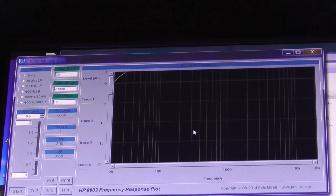Now, ideally, if I can, I want to be able to adjust these tone controls so that when it says it's flat, it is actually flat. I don't want a big... Well, you can see we've got a good 3 dB boost there. So yeah, the previous run was clipped. It should hopefully flatten out fairly well here. Look at the response on the audio analyzer at the moment, and it's pretty flat now actually. Looks like it's rising again.